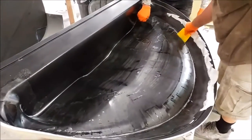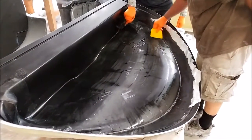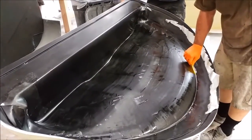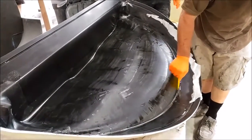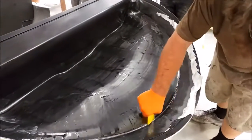If you recall from last week, the guys had finished laying up the mold for the glare shield. Here's Jeff and Mark laying up the part itself. It's pretty simple — it's non-structural, so it's just a couple of layers of carbon fiber and not even necessary to vacuum bag, even though we set up the mold to handle that in the future.